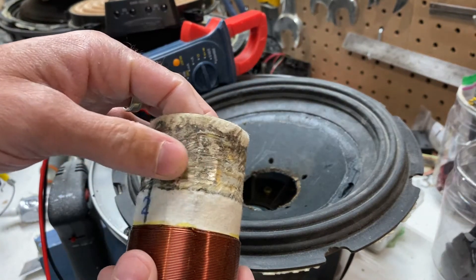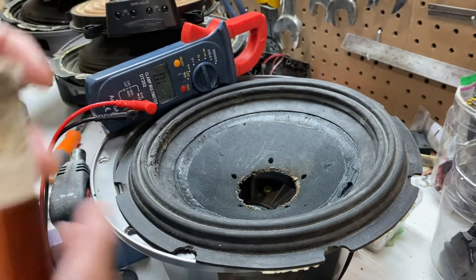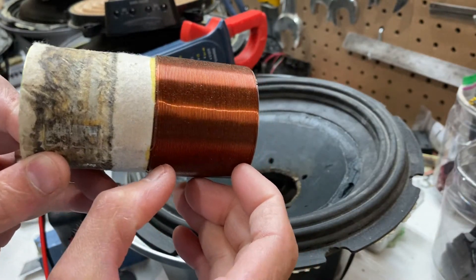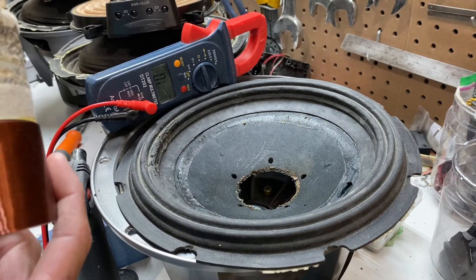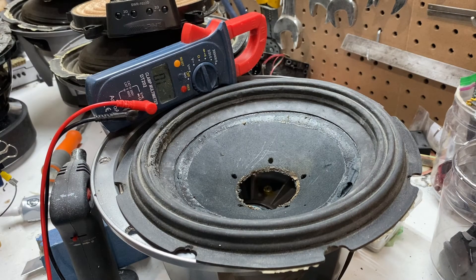The nickel strips are connected to the voice coil, and the voice coil is in good shape. This particular coil is going to go into this Sundown. It's a 500-watt Sundown SA8, and I'm going to put a 500-watt Alpine Type R dual 2-ohm in it. It will have an increase in X-max by about three millimeters — so from 19 to 22 or something like that.